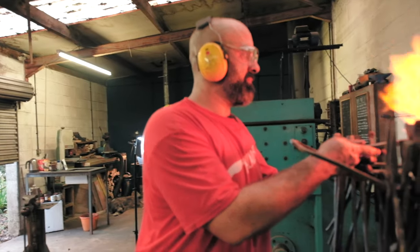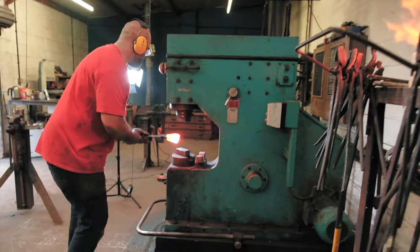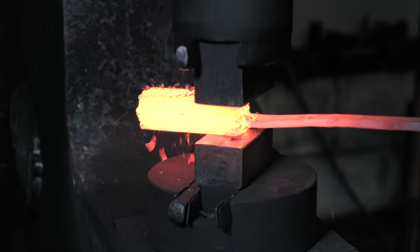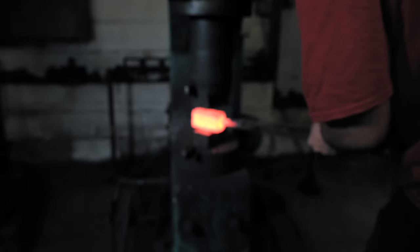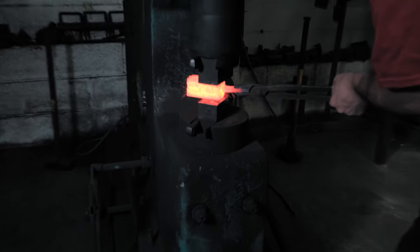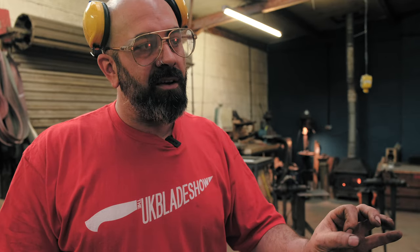There's a lot of people who take extraordinary levels of being fastidious to try and get stuff stuck — they put stuff in cans, they use tons of flux, they put things on it to make sure nothing oxidizes on the outside. I'm at the school of thought that if it does oxidize a little bit on the outside, I can whip it off with the grinder or the disc. As long as I'm not working too thin, I'm not too bothered.